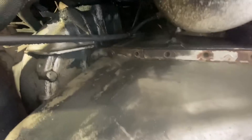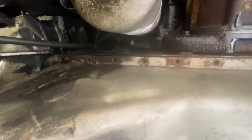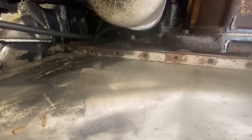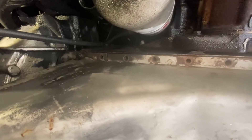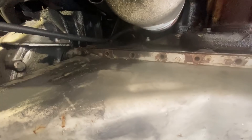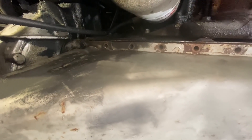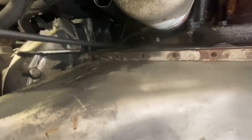So we're under the 8V92TA. We're dropping the oil pans — we've drained the oil out already. I'm removing all the bolts here, taking the oil pan down, and we're going to do our bearing inspection — main bearings and rod bearings. This is just something we need to do on these 92 series because that's the weak link to them. We've got about 150,000 miles, which seems really low, but let's just do the inspection.